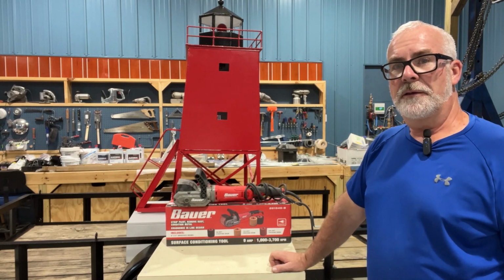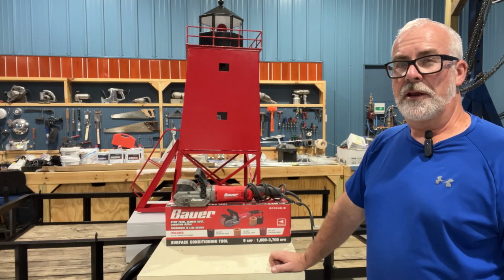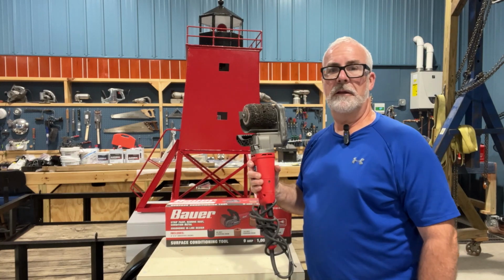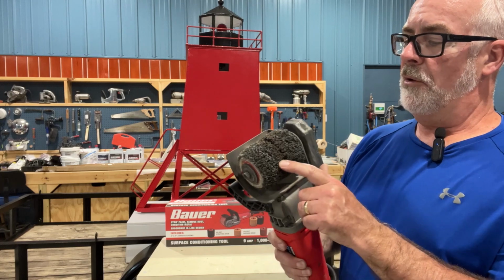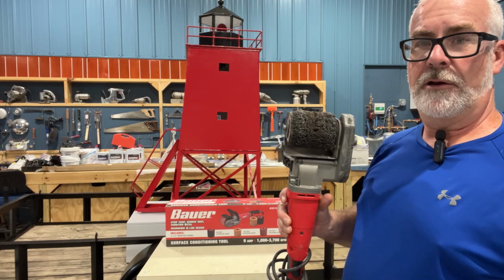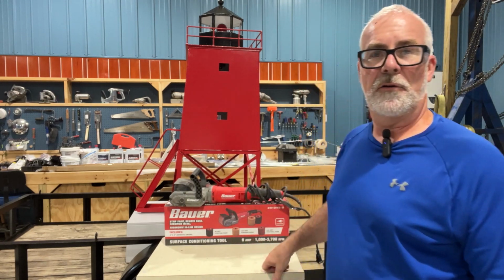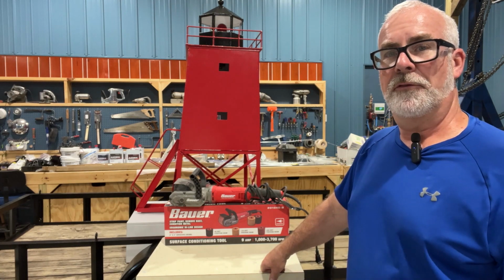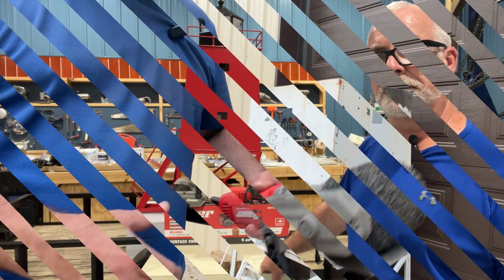I used it lightly, meaning probably, I think I used it 4 hours straight overall, and I used a 40 grit, the drum, it's a sanding drum. I took that right down, I still have some left, but for 4 hours on a 40 grit, it was amazing how nice that looked. At the end, it was like a mirror finish, but it still had enough tooth that my primer and then paint would have something to grab onto. So let's get to seeing the machine work.